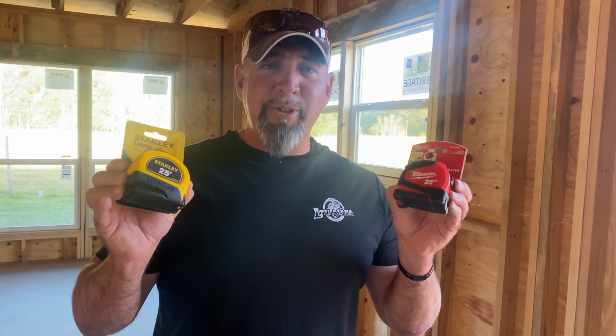So now would be one of those times that it would be really, really handy if you was actually a carpenter. We can do pretty good with the straight cuts and the angled cuts, but we're fixing to have to take this side and around the door. That is an archway. So Jim picked up a jigsaw today, that way we can cut around the door better. But I'm pretty positive they don't make a fiber cement jigsaw blade. If they do, I couldn't find it. I mean, like specifically saying fiber cement blade.